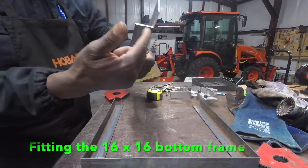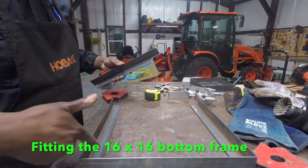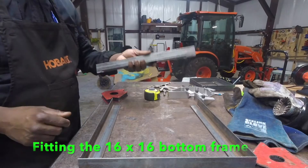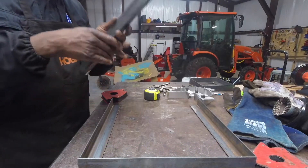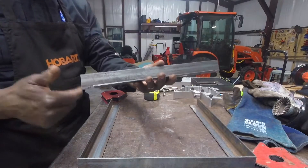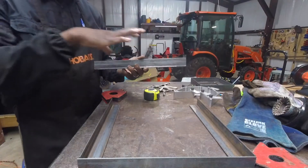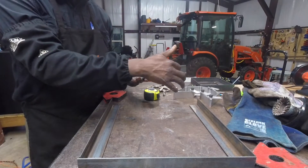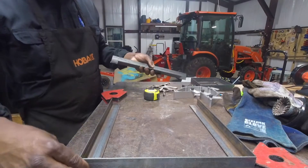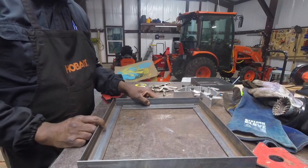These are the notch cuts that he's talking about. You can do a miter cut where you have one seam in the middle — I still haven't learned how to do those yet, especially with angle iron, so I have to practice on that some more. What I did is go ahead and do the notch cut. What it does is, whatever you're attaching it to, you cut that same width out of it, and it allows it to fit up flush perfect.